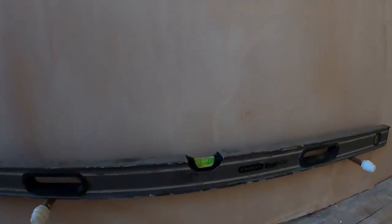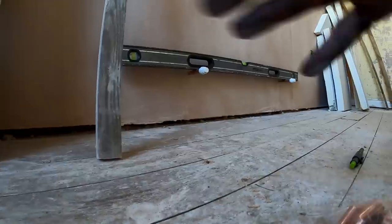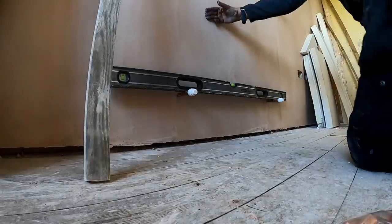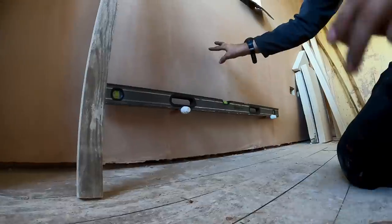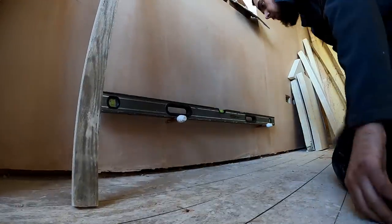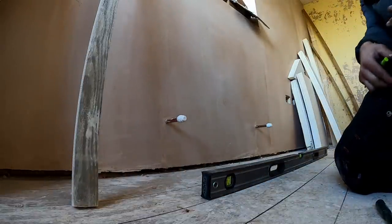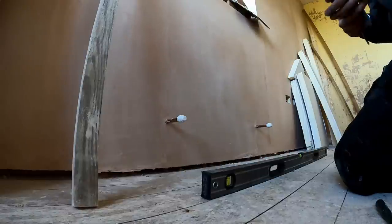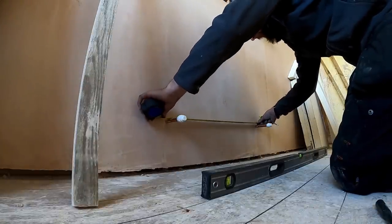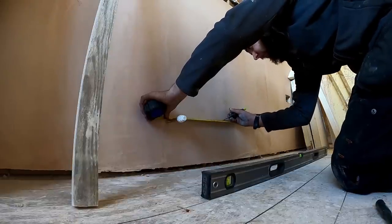It's my mate who actually first fixed these. He's not bad, but he was taught by me. He's a good lad. Pipes are dead level. Because these walls have been insulated out, I think we've got 75mm Kingspan on them. We have put backer boards where the brackets are going, so we should just get away with using wood screws straight in. This is a 600 double going on. The pipe should be at about 690, all things being equal. About 695. So half of that is, quick maths, just under 350 in. Somewhere there.